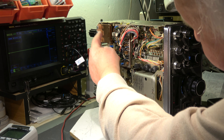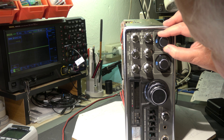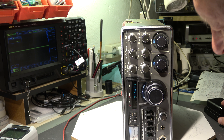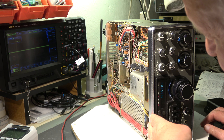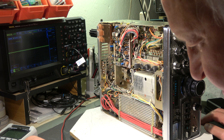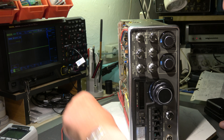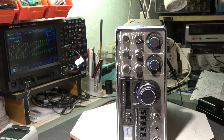This is in the mixer unit which goes to the driver and to the PA. So it's necessary to switch on the VFO operating — I did it — and then connect the CW key, key down. Then we have an output power and the ALC control is set so that the output power is maximum, meaning VR2 on the mix unit does not limit the output power. This means this pot is fully counterclockwise to the left side, and then we have maximum output power. Then we can switch off the output, and when I key we see the output of the generator unit. Now in CW, adjust T1 and T2 for maximum.